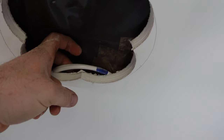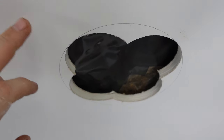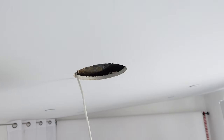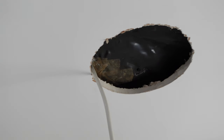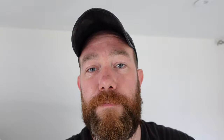Look at that — lovely clover drill! The cable is here, connected down to our spur. I'm going to get the pad saw out and finish off the hole. Look at that with a pad saw — what a talent! Here's our cable. I'm going to get some Wagos from the van and a Wago box, cut the plug off, and joint it onto our power supply cable.